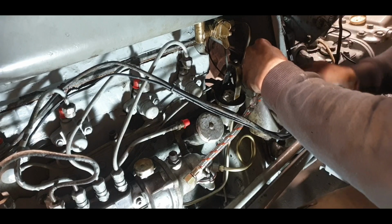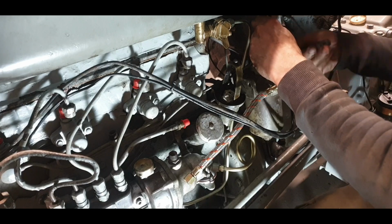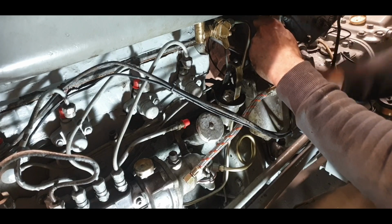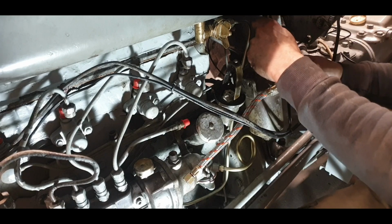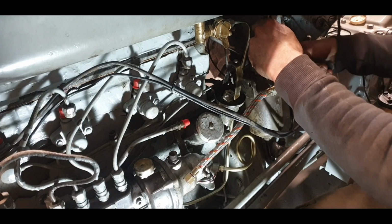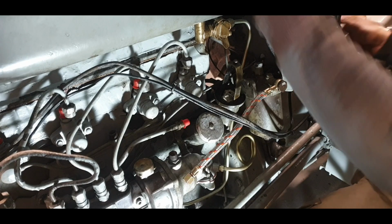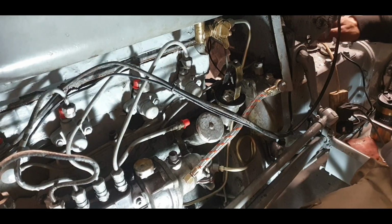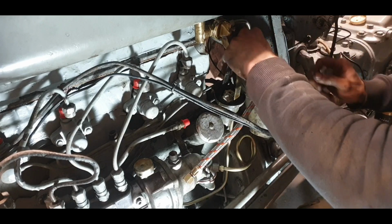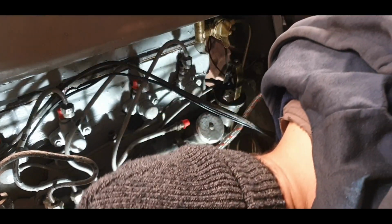And then we look in and we hopefully don't see any issues with things getting in the way, because you have to bend these pipes. There's a lot of other pipes in the way. You have the high pressure pipe, you have the pull to stop lever that can get in the way. So you just make sure everything's coming there handy. Pull to stop is working. Okay, lovely. We can tighten him up, 5/8.